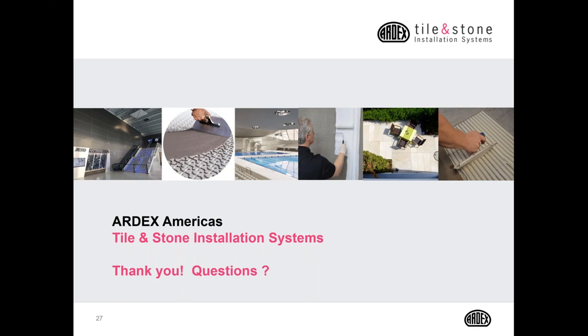Perfect. And you actually answered a follow-up question that we had about application, which is the best waterproof membrane for a steam room or a steam shower. I don't know if that's residentially or commercially, but maybe you can touch on both. Yep. So there's two different types of steam rooms or showers. One is your residential steam shower. That is where it is your home shower that has a steam unit placed in it. Most people will use the steam shower every now and then, maybe at most once or twice a week. If that's the case, you can use ARDEX 8+9 as a waterproofing product in that steam shower or the SK175. For commercial steam rooms that are in fitness gyms where the steam room is on 24/7, you must use ARDEX SK175.